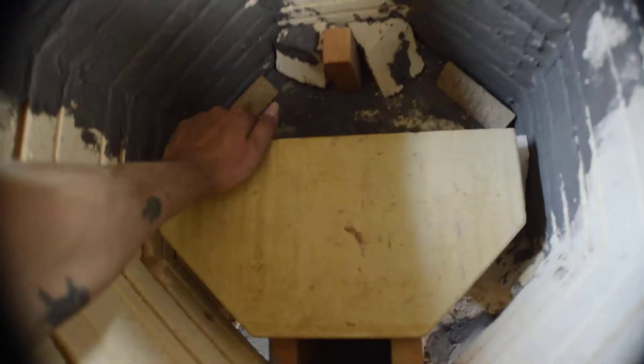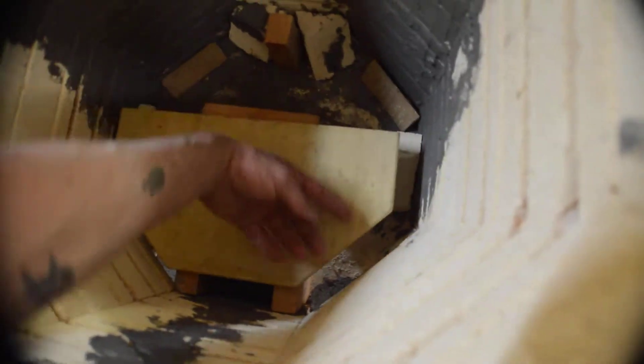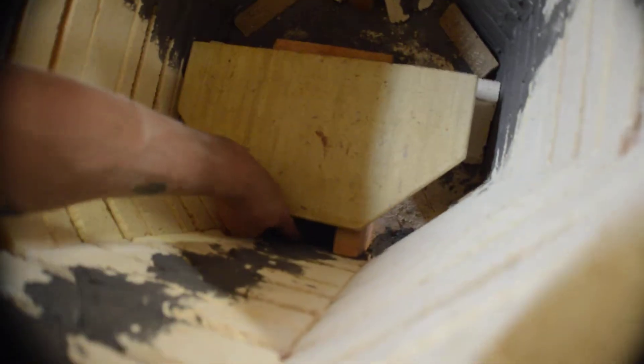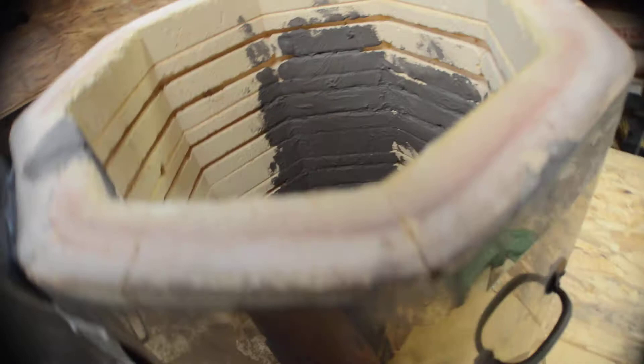So this is where it's a little different. This will be the entrance to the flue — it'll be covered from here to here. So the jets, the heat, will come in, hit each of these little ramps, get shot up throughout the kiln, tumble around, and then come back down through here and out and up the flue.